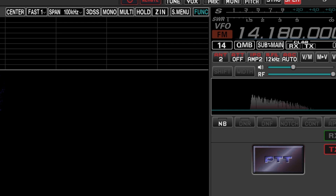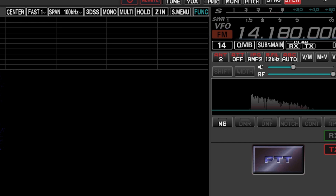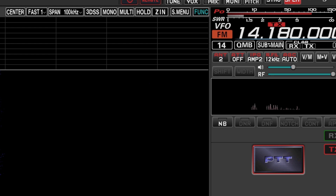Here goes the LMR400 — let's look at the SWR. The SWR is about 1.7 to 1, so the SWR went from about 1.3 to 1.7. So why is that? I'll go back to the RG8X. In both cases it's putting out 100 watts and most of that is getting to my dummy load. Why would the SWR go up?